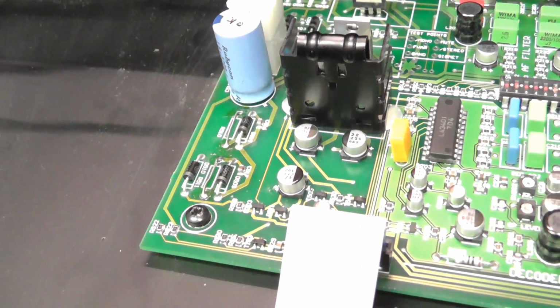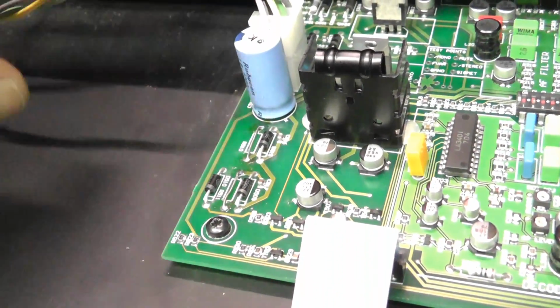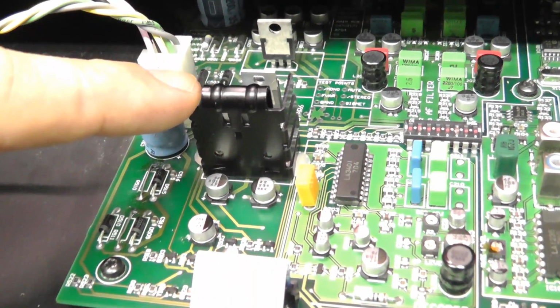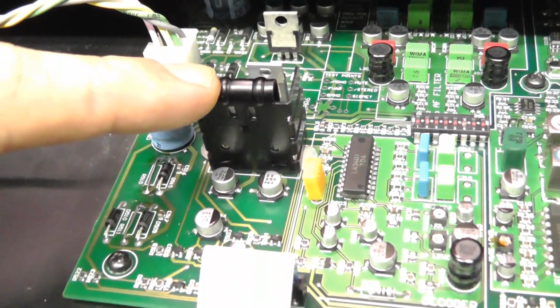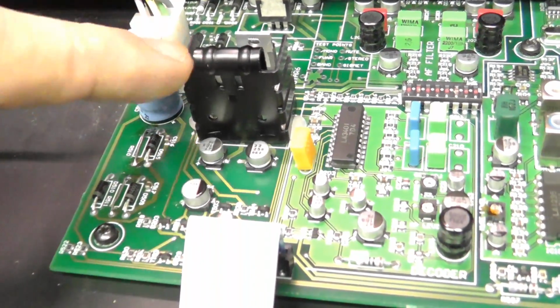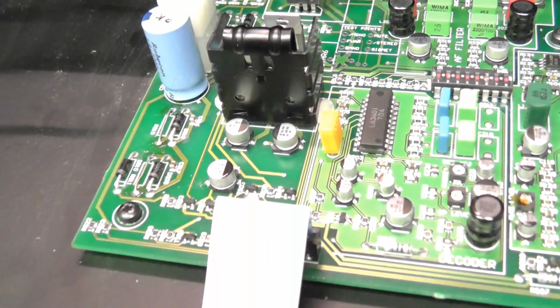Basically these resistors are the cheap cop-out for fuses really. They are limiting the current slightly to the linear regulator, but the linear regulator is only going to make maybe a couple of volts maximum difference to the input. The linear regulator will still regulate to the same output, probably 15 volts. So we just increase the input to the linear regulator slightly. That means it's going to run slightly warmer than it did before.